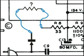This is the testing that I do to determine first if I need a resistor, and then what I do to determine what the resistor should be. I just simply use alligator clips from the 2 points in the circuit to a resistor. That way I can quickly change resistors.